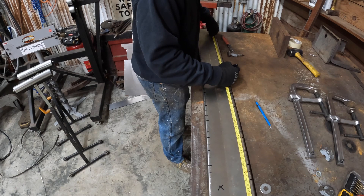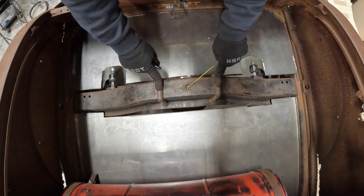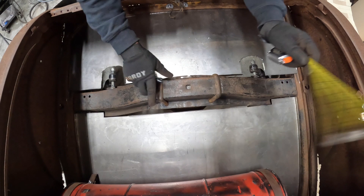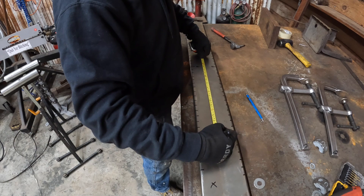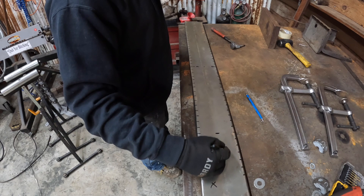I'm four inches on each side of the center — that's where my U-bolts are. It's already starting to curve down there, so I'm going to start the arch right in the center and want it to have a continuous flow with no flat. I'm going to do 12 inches, which brings me pretty close to the transition where it'll start flattening back out. My focus is going to be 15 inches from center on either side — that's where the flat starts. So this whole section between these two lines is going to be arched. Now I'm just going to get to work on shrinking.